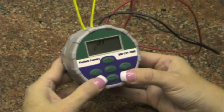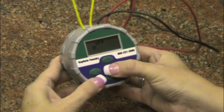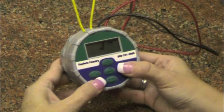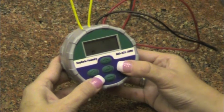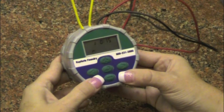Conducting a manual test flush: press the main menu button and go to the home menu, which will show you the current time, battery life, and day of the week. Press and hold the right arrow button until you see a small open hand on the left side. Release the button and the controller will count down 10 seconds until the test flush begins. The controller will run for as long as the duration set time is scheduled.